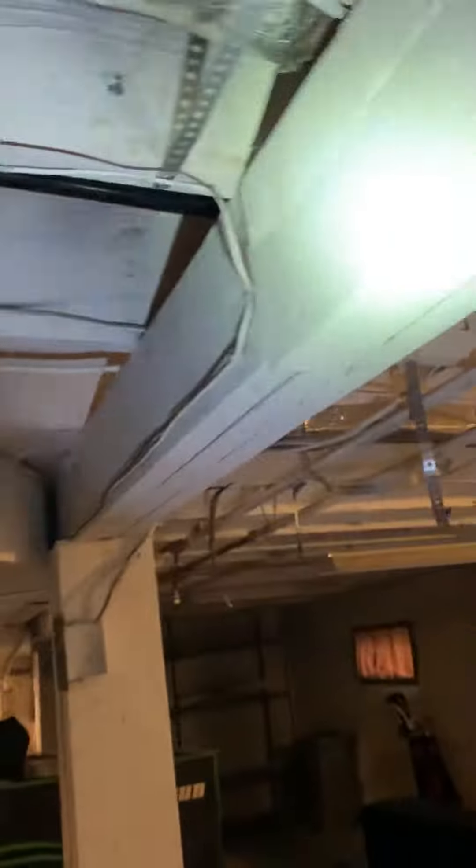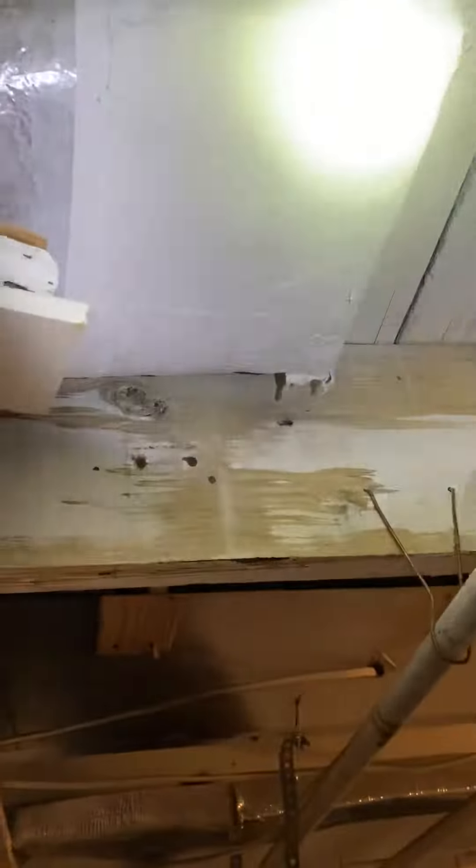There are a couple of runs that come off of here. It looks like one goes over and hits a few areas in this back crawl space area, then another one coming off to see what does first floor and what does second floor. We have another supply that comes over and catches this opening, one's capped off, and then we've got a trunk line that runs the length of the beam, kind of parallel with the beam.